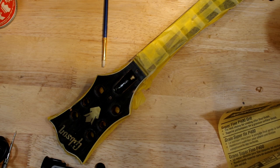And everything is looking just perfect. So the matrix that is formed by the nitrocellulose is really different than the matrix by those plastic finishes, and because it is soluble at all levels, it's really, really important to put it on in thin layers. And that's actually how I run into trouble with this job, because the thin layers, I'm using a brush for my touch-ups, which I was hoping would work, but at least I have the barrier coat of the vinyl sealer there to protect the finish underneath.